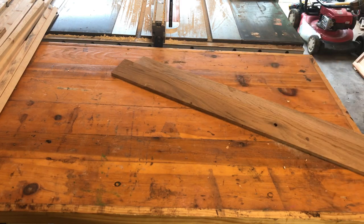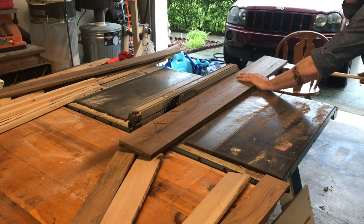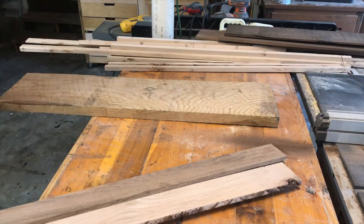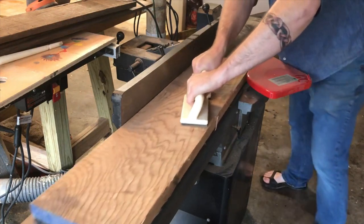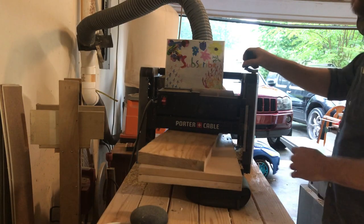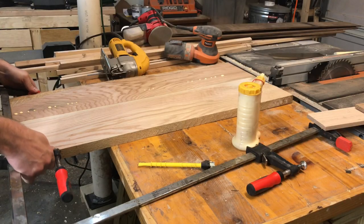The first thing I'm going to have to do is get my stock together. I'm sitting on a bunch of red oak and some walnut, but this piece of walnut is a little too thick, so I'll have to cut it into thirds and use those three to put on top — I'll cut it with a table saw and then finish it off with a hand saw. I'll take my red oak and I'm going to need two pieces, so I'll joint those at the joiner on one face and one side, then run it through the planer. I'm going to joint that and edge glue it together, and this will make a solid panel.